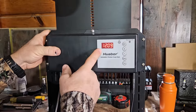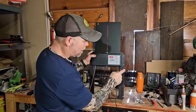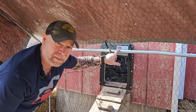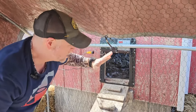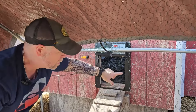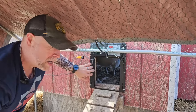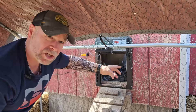We do have the chicken door installed out at the coop — it was just four screws, real quick and easy to do. We have power coming out to the coop, it's plugged in, the time is set, and I've got the open and close set for 7 a.m. and 6 p.m. One thing to make sure when you do your test is that if the frame is bent, the door is not going to close all the way. So make sure when you're putting your frame screws in that you don't put them in so far that you warp the door.